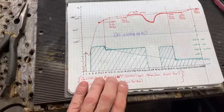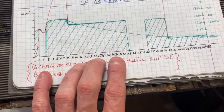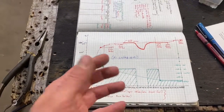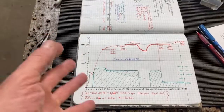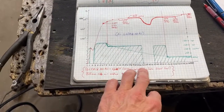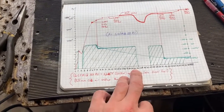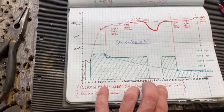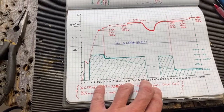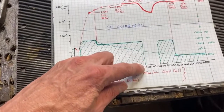It's always been my experience that you need a minimum of 20 minutes to get a crucible to full temperature. I've done a lot of e-waste anode sludge smelting and e-waste smelting, and I have found that anything under 20 minutes the bottom of your crucible is not at full temperature yet. So keep that in mind — 20 minutes is a good time to get up to 2,500 degrees inside the crucible.